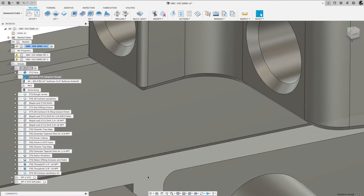Okay, Stuart Duncan asks, is there any time that you would not use smoothing? Is there any time that I wouldn't use smoothing? I'll use it probably 99.9% of the time. It does increase calculation time. So if you have a part the size of this and you need to recalculate it with smoothing on, you will get a certain calculation time. And with smoothing off, it will calculate quicker because it doesn't have to figure out each arc move and whether it's in the tolerance. So it will generate quicker.